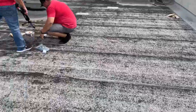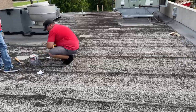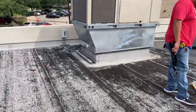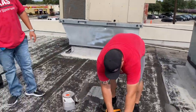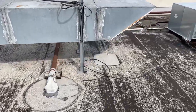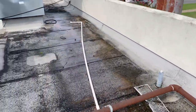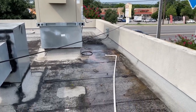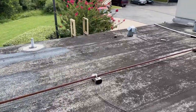Next, I'll do an overview of this roof. It's a fairly small roof — maybe two to three thousand square feet. We have two AC units, and it is sloped. We have a gas line, an AC unit here, and then there's a leak. You can tell right there that pipe is leaking and someone has disconnected this PVC, so this whole thing is getting flooded and water is getting inside.